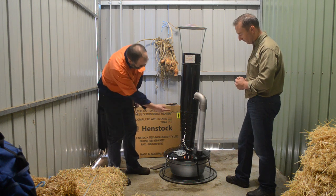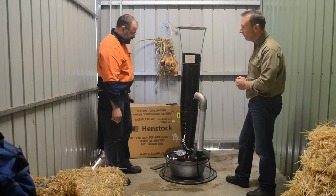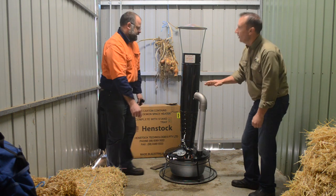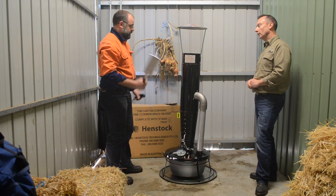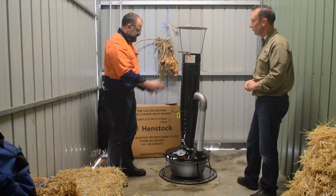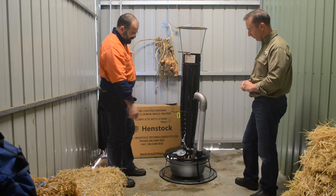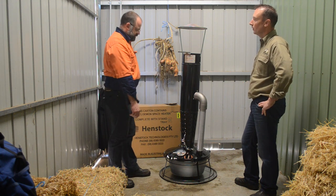You can see now the flue's already just getting a tinge of red in the flue. At this point I'll just close that down a little bit, because you probably don't need it burning much more. You can really hear the change. And if you want, you can now put your economy damper on — that just keeps some heat in the flue, keeps it all hot, stops the air rushing out, and that'll help make it run a little bit longer. You probably wouldn't want to close it down too far at this point; keep it sort of open.